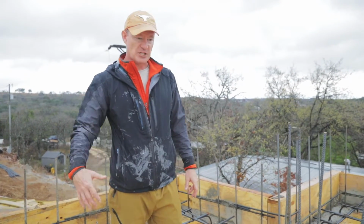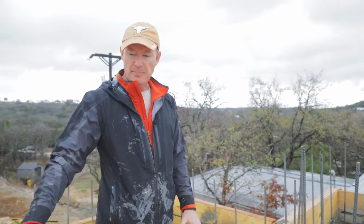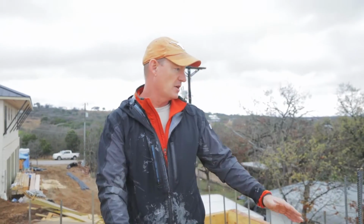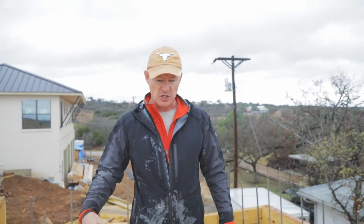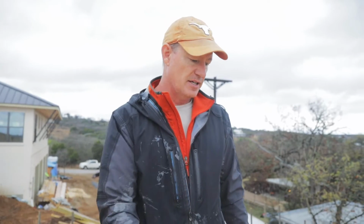It takes all this conduit, because above this, once we pour the concrete, this is a bathroom, this will be a bedroom. And you can't just run the conduit straight up through the floor. Otherwise, it'll actually be stained concrete. So it all has to be done in the slab instead of on top of it after we do it.